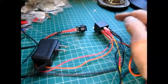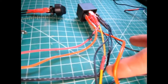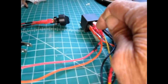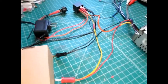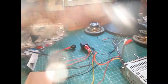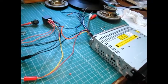So what I finally did is: the 12 volt that was turning on the relay to allow the ATX power to feed the radio — I turned off the relay first, so it's an instant switch to the wall wart power, and then turn off the ATX. I just have to remember to turn on and off the relay instead of relying on it to automatically turn on and off. It's kind of a pain, but better than resetting the radio.